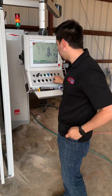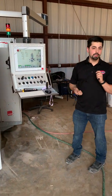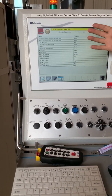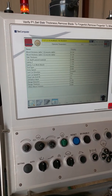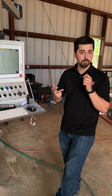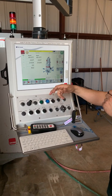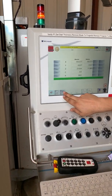Let's do the blade next. Raise this thing back up. Now we've got to change the tool type back, so click F9. As soon as I come in here to try to change it, it automatically says calibrate the blade — it asks you for the blade right after you do the finger bit. That's why I said if you're going to measure both tools, do the finger bit first. Now escape — it's set to the blade. Same process: F1, and if we have the air cylinder, use F3.